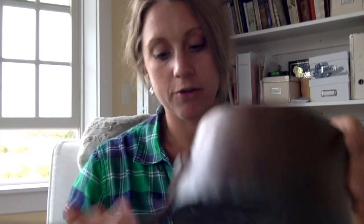It will crack if you hammer it too hard and too fast, or if you get it too hot or not hot enough. It's a super delicate, painstaking process — but you can actually get it to lay true and sit flat on the stove again with that process. Then you'll remove the verdigris and the decrepit old oxidized tin, because it is past saving in this shape.